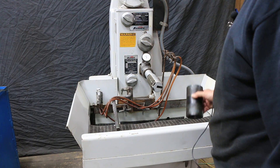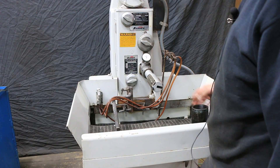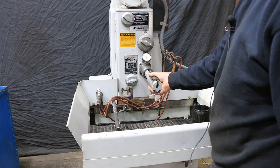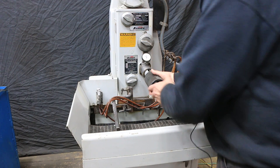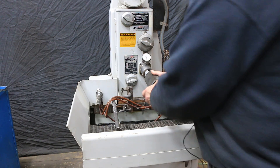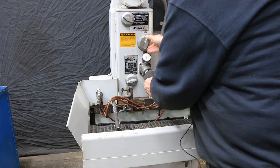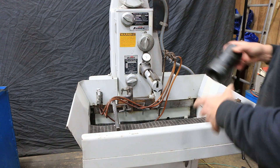Basically, you work your stones in and out by pressing the lever down, and you can actually feel them going up and down here. When I slip my sleeve over this and close this, I can adjust my stones to a certain preset size.